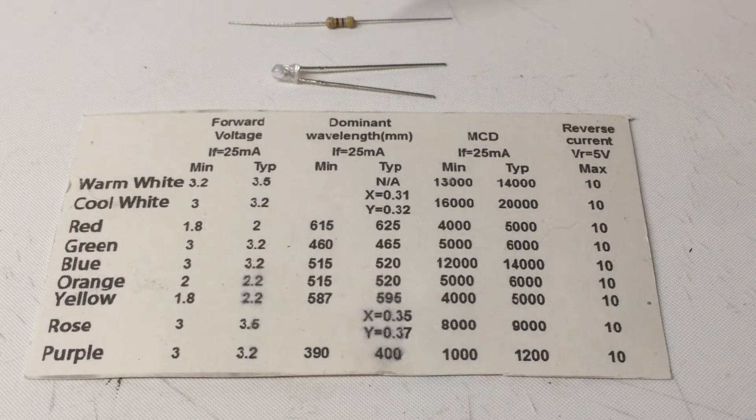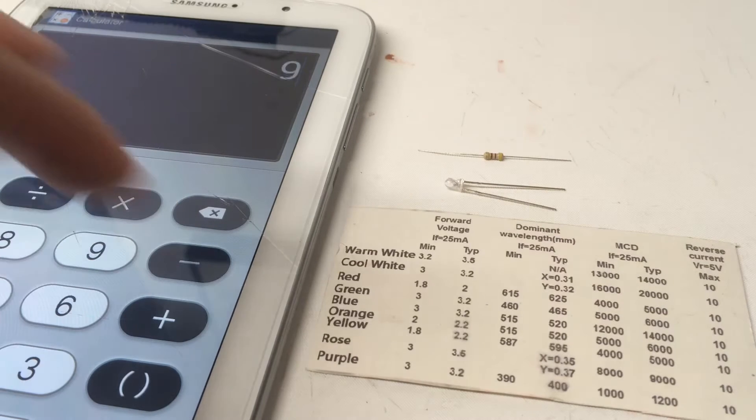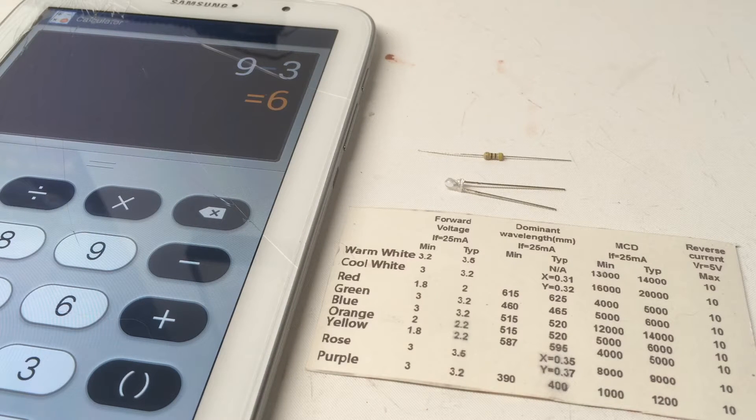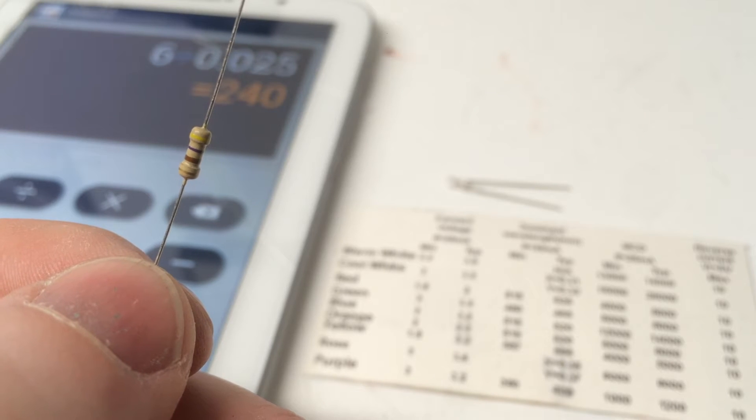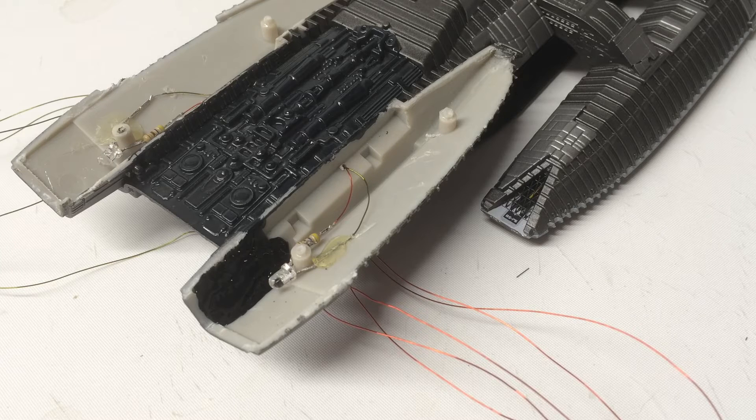There's a way to calculate the resistor value, and here's the quick rundown. The first thing we need to know is our power supply — I run 9-volt power supplies. So we take that and subtract the minimum voltage, which is 3 volts, which gives us 6. Then we divide that by the milliamperage, which is 25 milliamps — divide by 0.025 — and that gives us 240. Now I don't have a 240; I'm actually running a 470 ohm resistor for my engine LEDs. The value is higher, but it still allows the minimum voltage through. That's working with LEDs — it's actually pretty simple. It might seem intimidating the first time, but once you get going, it's super easy.